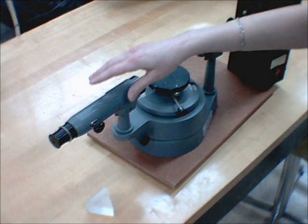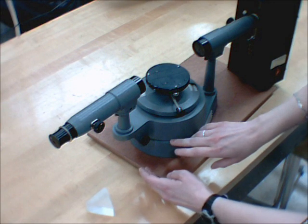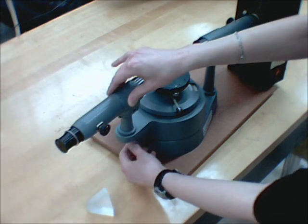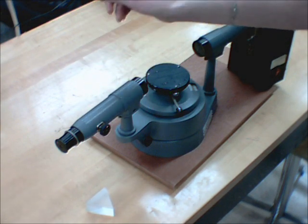You can lock the telescope and the table independently. I'm going to show you where the knobs are for the Surrey apparatus, but they'll be in slightly different locations for the Richmond apparatus. To lock the telescope, which is currently freely moving, there's a little knob down here, and I tighten that up so now the telescope does not move.